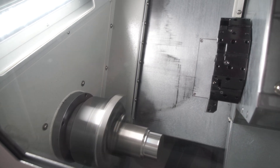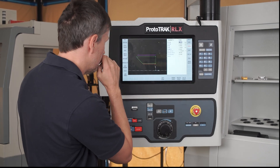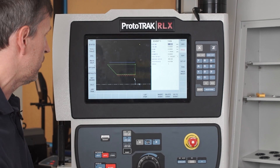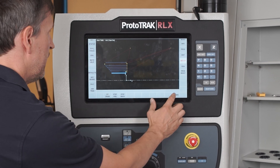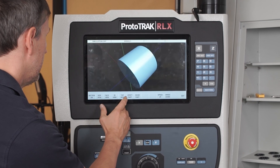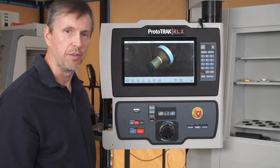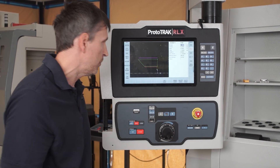In terms of the control, it's very similar to what we have on our tool room products. The main difference is we are now machining on the back side of the part, as turning centers typically do, and so our graphics now show that — everything is on the other side of the center line. If we take a look at our tool path, you'll see the same thing. And if you were going to verify the part to see it graphically machine away, this is how you verify that your tool path is good. Everything looks good, and again it's giving you a view from the back side of the part.